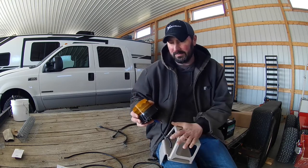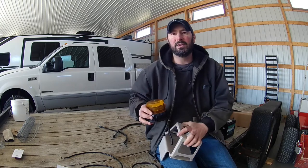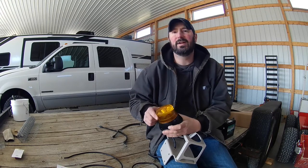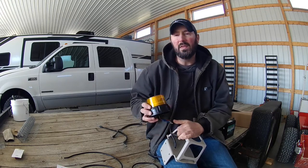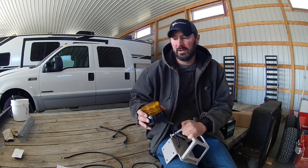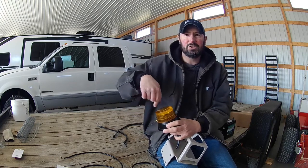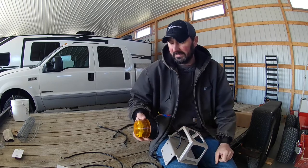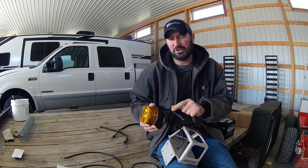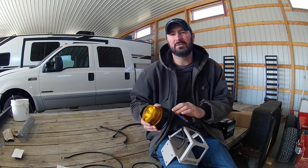One thing I will say is when you buy this light, it comes bolted here already — but I unbolted it and there's a reason why. This is a newer LED version; the dealer said they changed it about a year or two ago. When you buy this light it comes stock where the beacon goes around in a circular pattern. But if you take this light off and pull back the yellow wire a little bit, that is your mode selector wire — so you can change the pattern of these lights to different intensities.